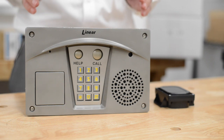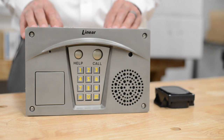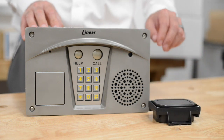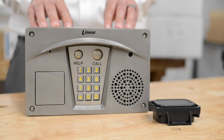What you'll need with this system is wiring. You'll need telephone wire to tie into your telephone line, and you'll also need wire to use the relays to your access control devices. The telephone line would get wired to this box. This is a bypass module — this module makes it so you can utilize this system and still utilize your telephone line as a normal telephone line.